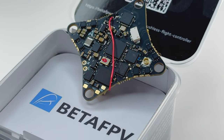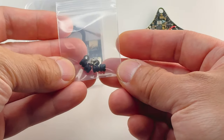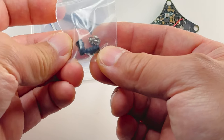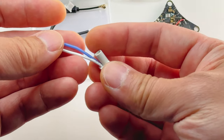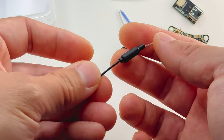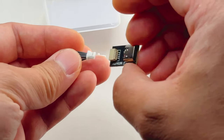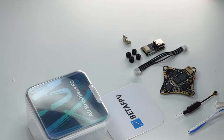What a beauty! I love geeking out over PCB. We have a bunch of hardware that includes four gummies and four M1.4x4 self-tapping screws, a BT 2.0 pigtail about 40 millimeters long, a 2.4G antenna, and a 4-pin adapter cable which plugs into a Type-C board so you can access Betaflight conveniently.